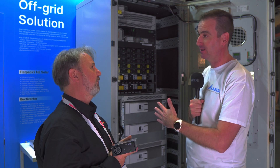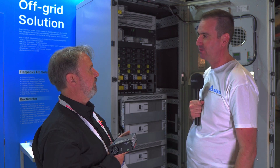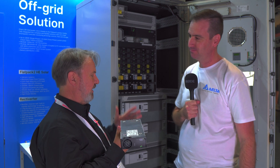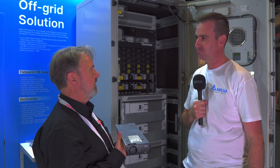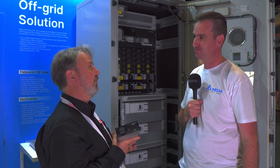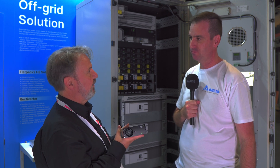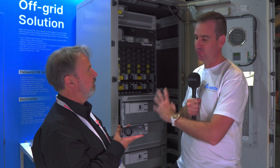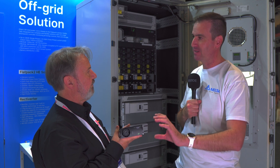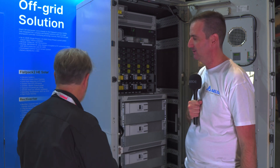So it's 1.2 kilowatts each, but you can build a bigger system. You can start at 1.2 kilowatts — if someone wants six kilowatts, sell them a system with six kilowatts worth of these. If they want more, send them a new one, hot upgradable, slide it in, and you've got another 1.2 kilowatts of AC available. The models aren't changing yearly — this has been around for quite some time and will be for longer. LTCH's main business is telco power supplies, so changing form factors and not making them retrospectively upgradable would be crazy. If a new model does come out, it will be retrospectively applied.